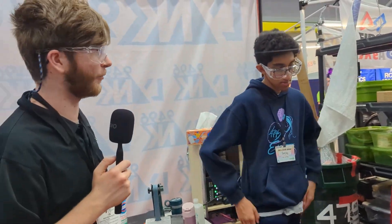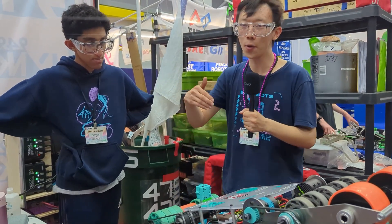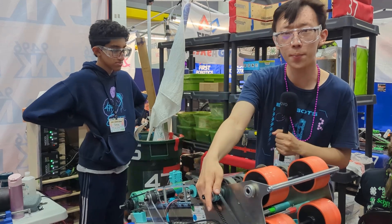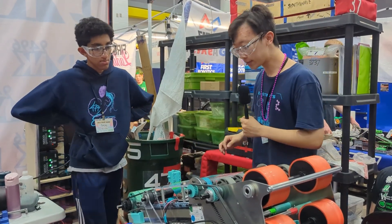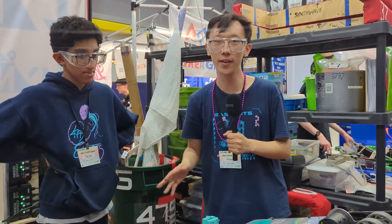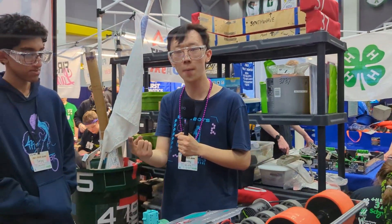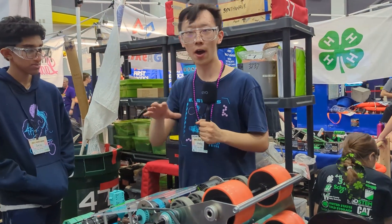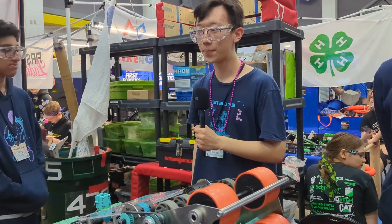I see a lot of 3D printed parts on your robot — can you talk me through some of the custom parts you used? Yeah, definitely. We used a lot of 3D printed pulleys over metal pulleys, because we realized that the flange on metal pulleys would get knocked completely off, whereas with 3D printed pulleys it would just take a little chunk off the flange instead of the whole flange coming off — so it's actually stronger in some ways. We also used 3D printed camera mounts, tube plugs, and a lot of semi-structural components. We used a lot of strong filaments — we used polycarbonate for our swerve wheels. They've been working great; on average we need to swap them every 4 to 5 matches, and they're very easy to swap and work with.